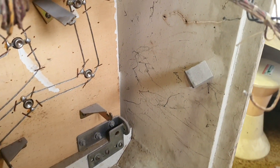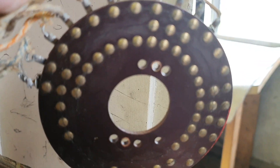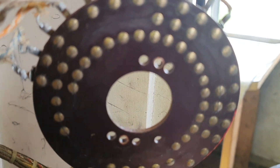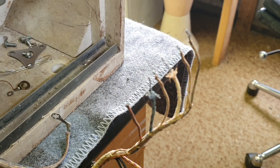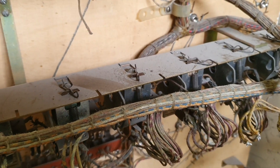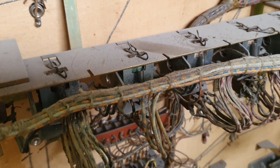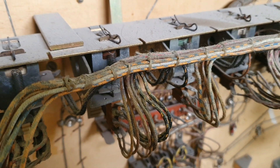There's the back plate of the other stepper — we haven't cleaned that yet. That's the light box stepper that still needs to be done. There are all the wires off the ball count stepper, which is yet to be done as well. We've still got to do all the relays — we'll take those out, check them, clean them, and inspect them for correct operation. That's where we're up to so far.